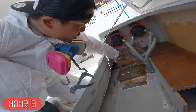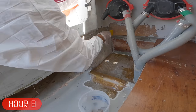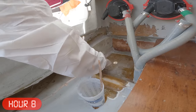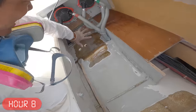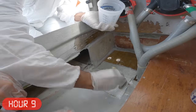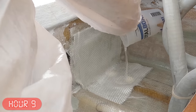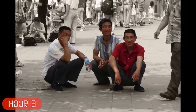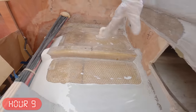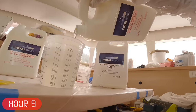We had to replace a piece of wood that was rotten. Thickened epoxy on the edges, mush it in place, and make a smooth fillet on all sides. We glassed all of this up into the wall. The forward section of the sun pad isn't exactly structural, so we only did two layers all the way around. I'm actually inside the sun pad locker, squatting Asian style. We're using Total Boat's high-performance epoxy — thank you for supporting our mission, Total Boat. There's a coupon in the description if you need some.